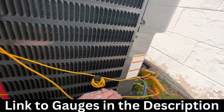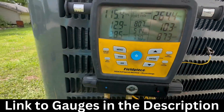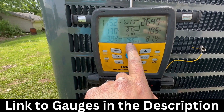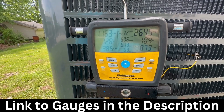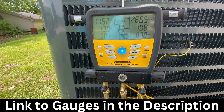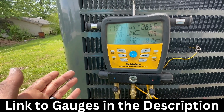The reason why I like these is that they come with sensors that tell you the temperature and do the math for you — so it tells me the superheat and subcooling at the same time. The vapor saturation temperature, suction line temperature is 51, liquid line temperature is 76.9. Basically what I do is I'll take a refrigerant app and it'll ask you whether the system has a TXV or not.